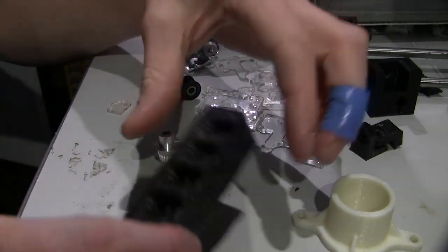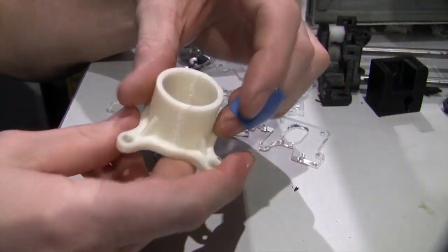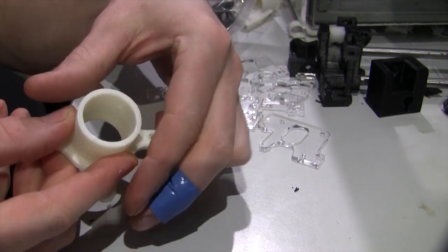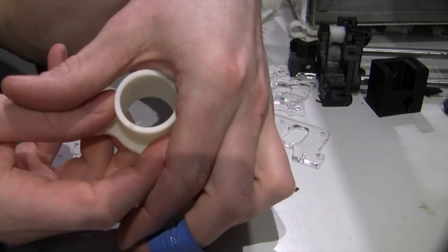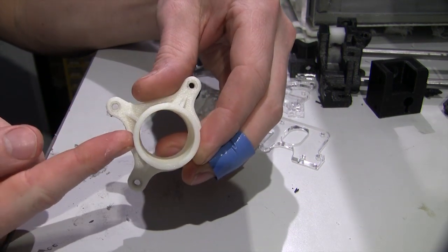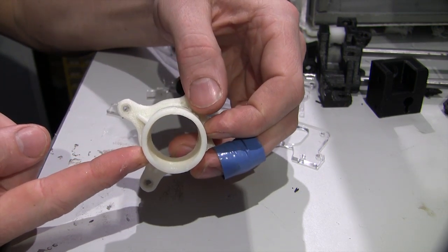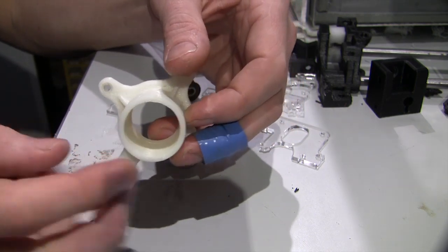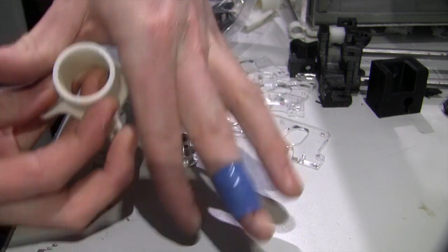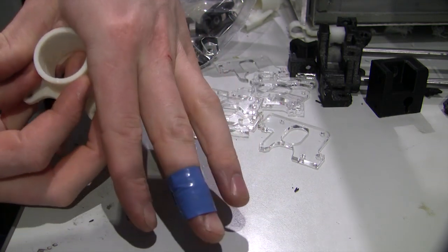So what that means, as I said before, with a square tooth you'll get slop in it like that and like that. Whereas if you have a rounded tooth, let's imagine the top of this is a tooth, so we're looking at it like that, it can snuggle up. They're actually not even rounded, they're almost a semicircle, so you get this nice curvy lump. And of course that's going to bury itself into the slot and not get sideways movement, because it's held nice and tightly, so it's not going to have the slop. It doesn't even need to be bottomed out.